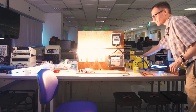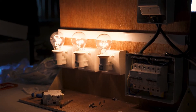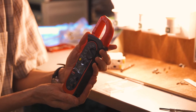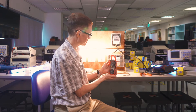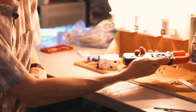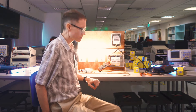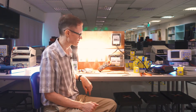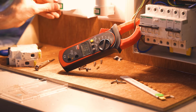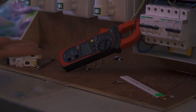Let's switch it on. Excellent! The circuit's working fine — these are all 100-watt bulbs, so it's pretty bright. I have a clamp ammeter here, which is common for AC circuits and very convenient because it just clips onto a hot wire and tells you how much current is passing through. Let's see how much current our entire circuit is drawing — we're drawing 1.27 amperes. As I turn bulbs off, we can see the current dropping to 0.42 amperes, and when I turn them all off, it drops to 0.